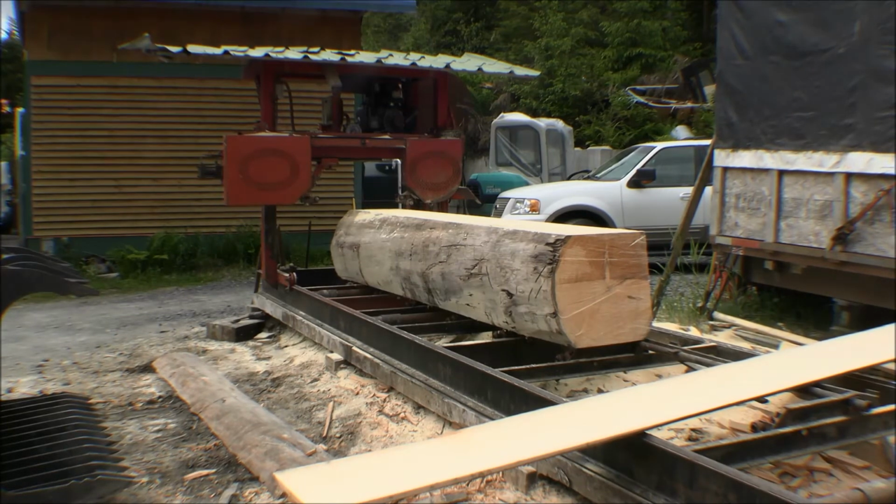So I was just looking at it, calculating what I was going to do next, how to get the most out of that. So I've got to go 18 inches. 18 would give me 3 6's, so I'd have to go 18 and 3/8. And then I could get 3 6's out of that. If I leave it this way, 21.5, that gives me 5 4-inch cuts on that.